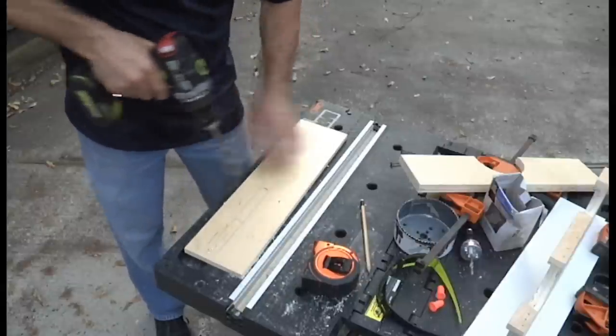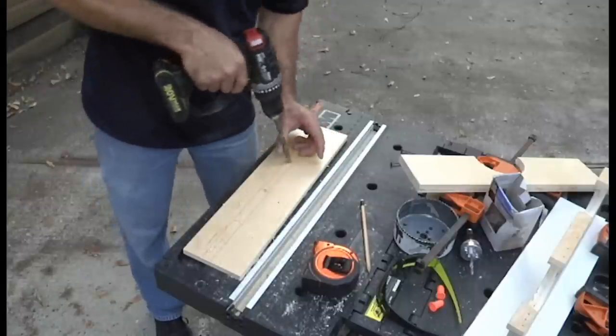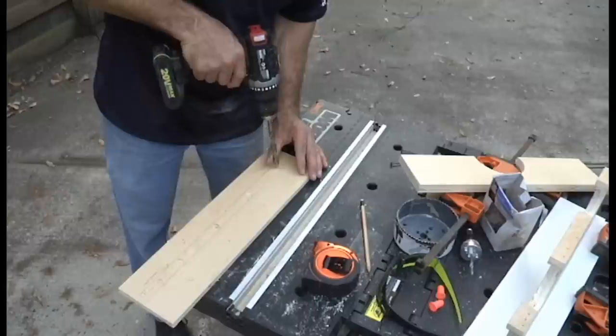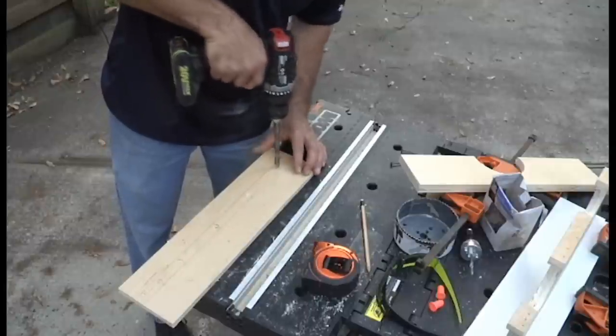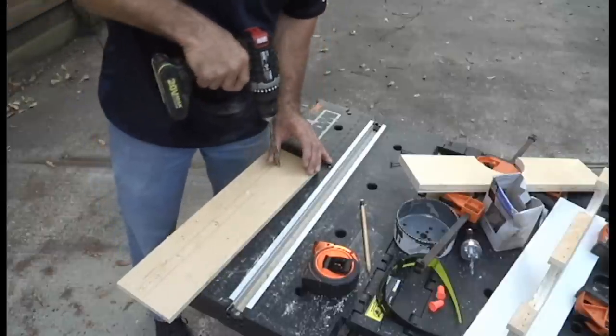Try to get it in the center. This is why I use three-quarter inch plywood on the sides — because you can screw into that. If you use MDF or thinner plywood, you may split it. You're not going to split three-quarter inch plywood — it's going to go in there and bite.